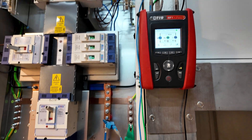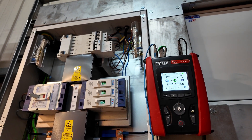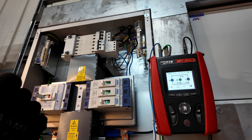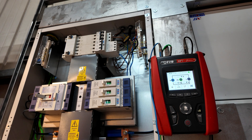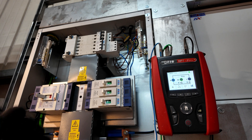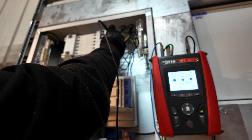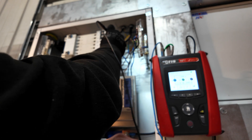I'm going in with one glove because I need the other hand to operate the camera screen to get the zoom and focus right, so I'll make sure I keep just my one gloved hand near these live parts. We've now energised that RCBO and we've got power up to there. If I probe on to L1 we should start to see a voltage on the instrument. With your GS38 probes they can be a bit fiddly to get on the screw head, so it's worth making sure you've got a good purchase on there and you're getting the measurements you need — and you can see we are.